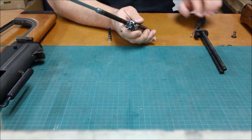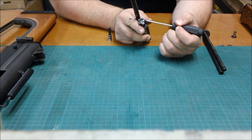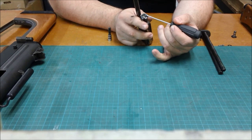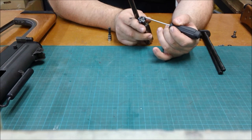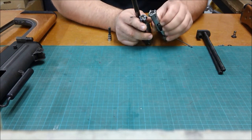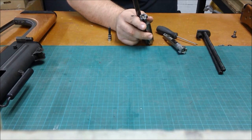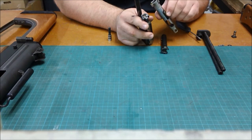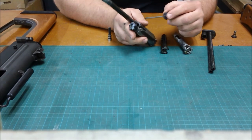One of the most well thought out designs of this rifle is the bolt, especially the bolt face. If you look here, the size of the ejector is 4 millimeters. The extractor is quite large and quite beefy. It was told to me that Uzi Gal spent 4 years just examining different sizes of ejectors and extractors. I have here an old bolt to show up next to it, with different ejectors and different bolt faces. You notice here, the bolt face is mostly flat. Here, the bolt locking lugs are all on an angle.